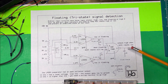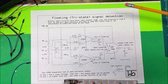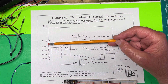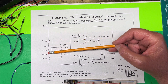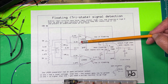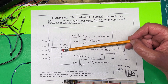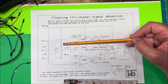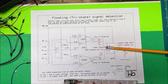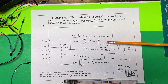Once I drew this circuit out I realized it looks just like a 555 timer. I started with 10k resistors and put five in just for fun. On a 555 timer you have the same thing — two-thirds and one-third voltage references with a couple of comparators. The trigger and threshold pins are tied together and go to the center of a voltage divider, with a resistor on one side and a capacitor that charges and discharges on the other. The two comparators feed out similarly.